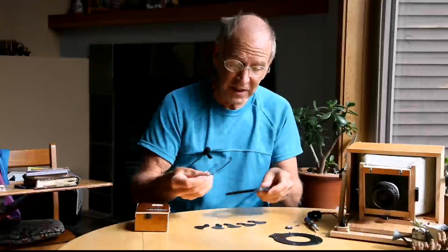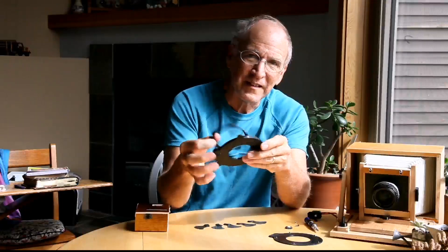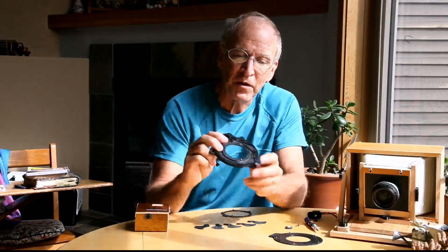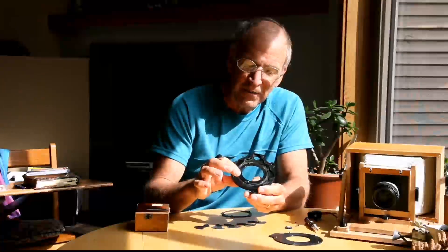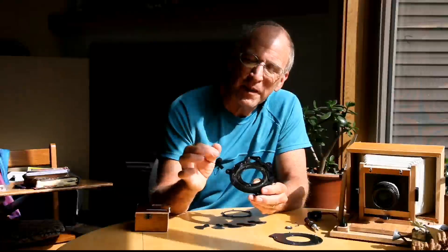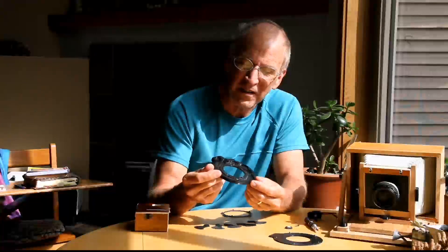This is the actuator — it has to fit in here just nicely and spin back and forth just right. It might look like it only takes a few minutes to put this together, but there's quite a bit of prep time after 3D printing. You'll also notice that one of the pegs broke off. I've had to cut a little steel peg, drill a little bit of a hole, heat the steel peg up, and sink it into the 3D printed base. That gives it the peg it needs — it's more permanent and it's not going to break off.